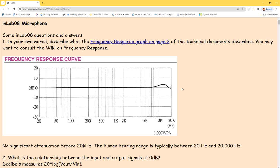If it tells you 3.3 kHz, could you find where that is? Is there attenuation for 3.3 kHz? Zero gain, yes, over here. It's not changing, right? I think it should actually provide that AC signal here. I don't think 0.3 kHz is the correct signal to give as an input, because it's flat. It's not on the ramp here.